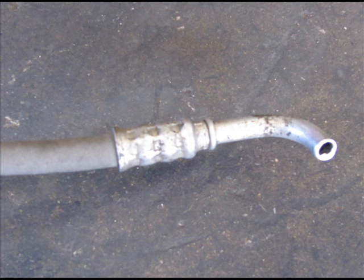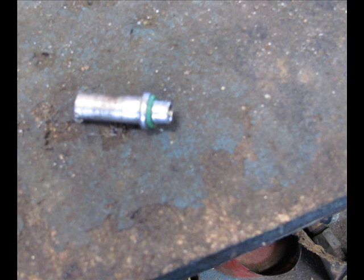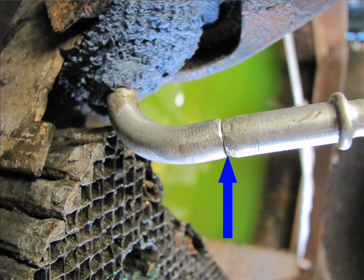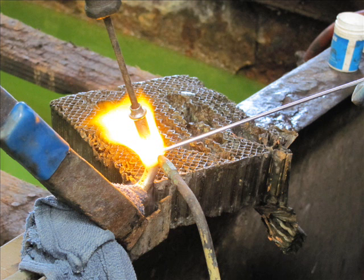The first thing we do is cut it apart, and then we prep the metal up, cut off the new piece we're going to put on there, and then we put them together in a vise and a jig, and then we weld them together with a rod. We actually use rod on these with flux. We don't use a TIG welder, although we have one. It's faster and easier for the bench guy to just use a torch to fix it.